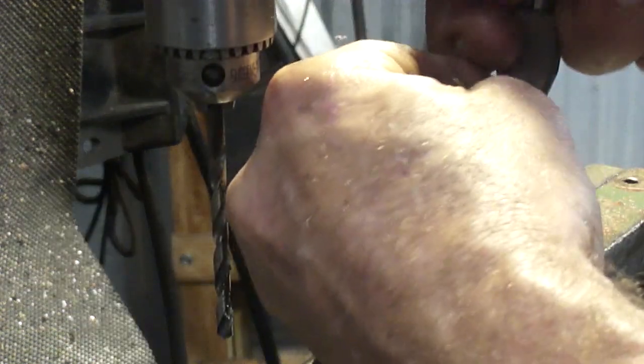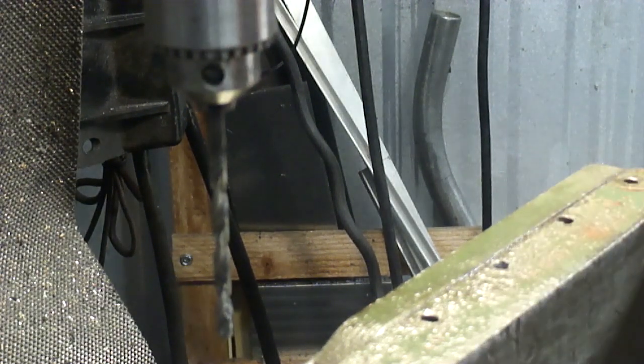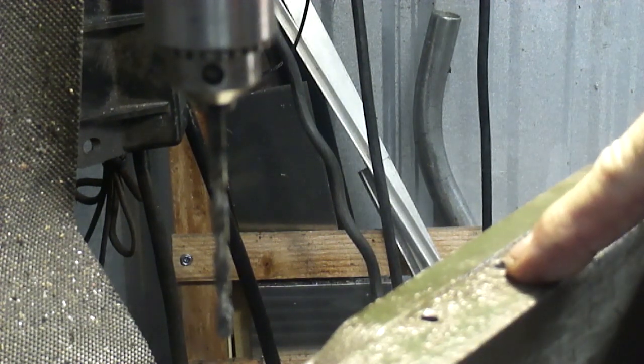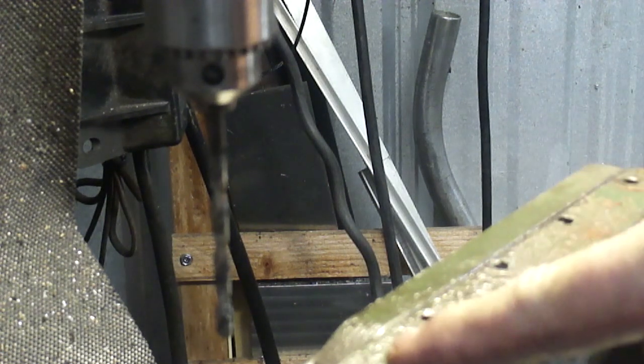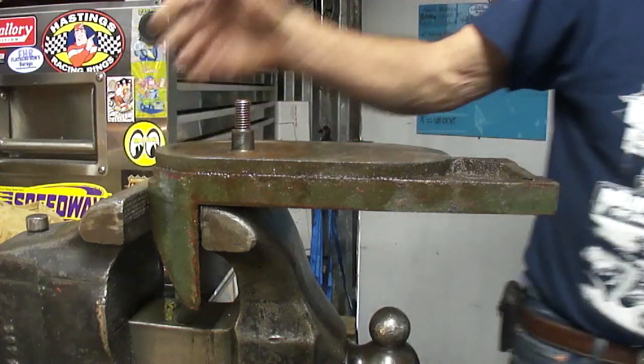See if I could stick a tap in here and get anything out. And if I can't, I'll just see if this will move a little bit for me. See if there's anything there I can get to reverse. Well, nothing. So I'm going to see if this is relieved enough pressure. I'm going to take it out of the vise, since I don't know what I'm doing, and hope I've drilled out enough of this so it'll relieve the pressure. Let's see if I can get this thing to slide off here. If I can, then I can just run a tap down through the hole and rethread it. So without banging on it, I want to see how, oh, I got it.